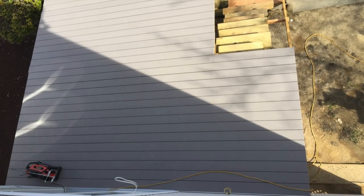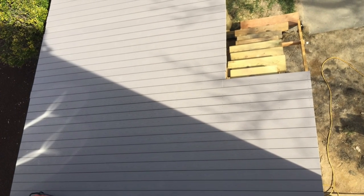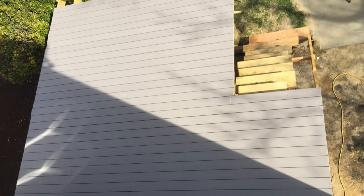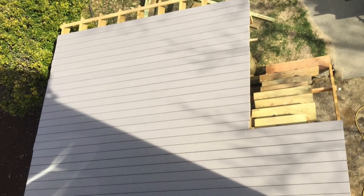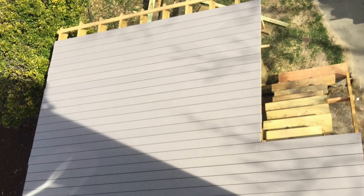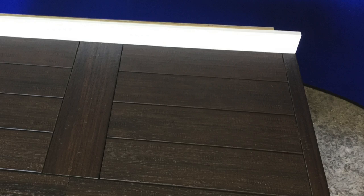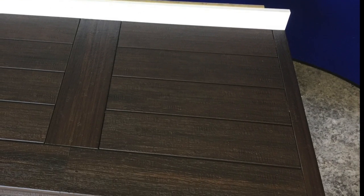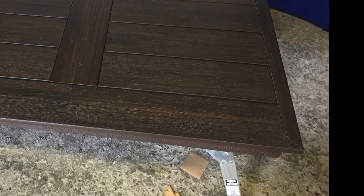It is important to note that we start a Dexerdry deck from the house. In most cases, you'll be able to let the joists run long until you've reached the end. With about 3 deck boards to go, you'll be able to measure accurately where you'll want to cut the joists. This is a Dexerdry deck being built as described. Using a 2x4 to keep the joists on center, we can get an accurate measurement on where we'll need to cut the joists and add the box framing. When building our model, we do just that. Knowing our deck is 5 boards deep, we can accurately frame it.